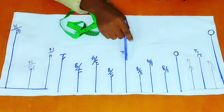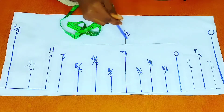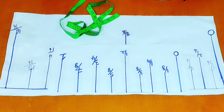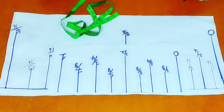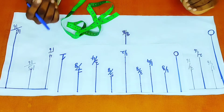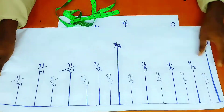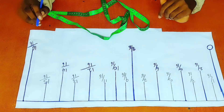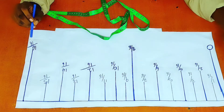If you notice, the fractions here all have different denominators — eight, four, two. The question one should ask is how come these values are here? So like I said, I have eight bars right here, but going back to the standard measuring tape, there are supposed to be 16 bars on the tape. So because there are 16 bars on the standard measuring tape, each bar is now over 16.